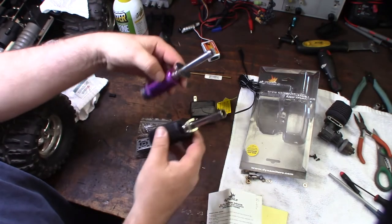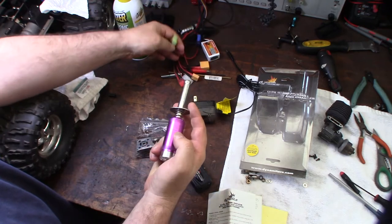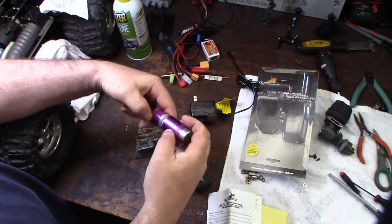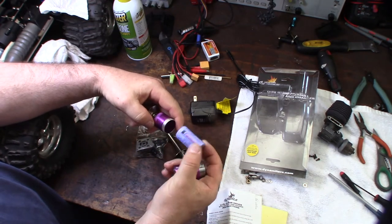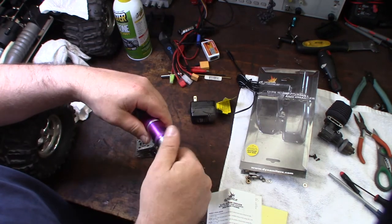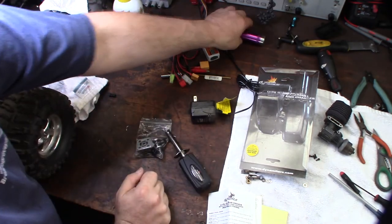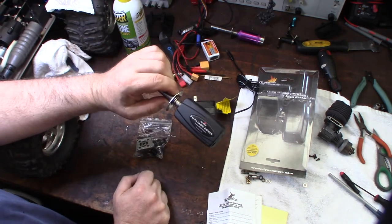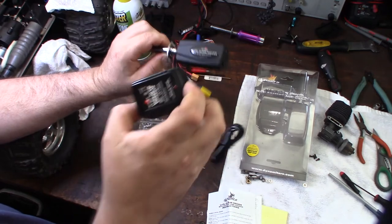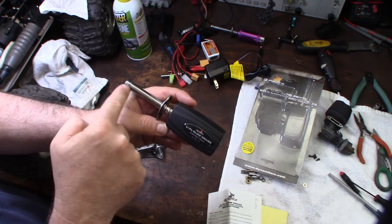What I'm mainly concerned about is front-charging. With the nickel metal hydride charger, I front-charge it — I don't take the cell out, I charge it from the front. That works because the NiMH cell is 1.2 volts, the same voltage the glow plug requires. But the problem with a LiPo charger is that the cell is 4.2 volts — you can see that on the charger label — and it uses a voltage regulator module to step it down to 1.2 volts.